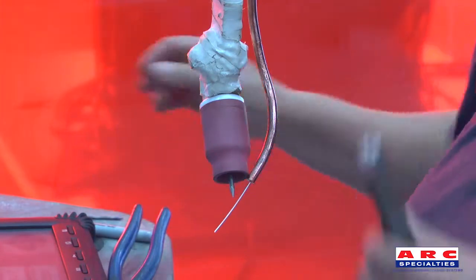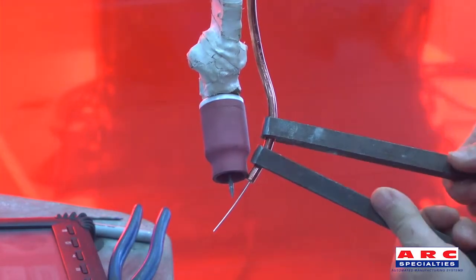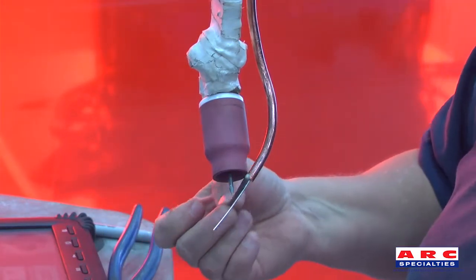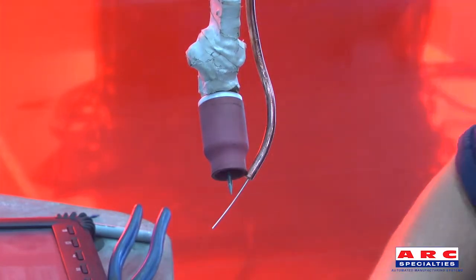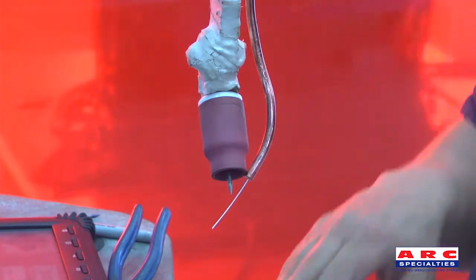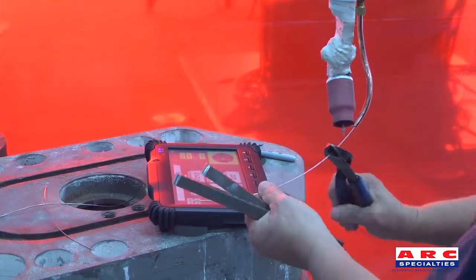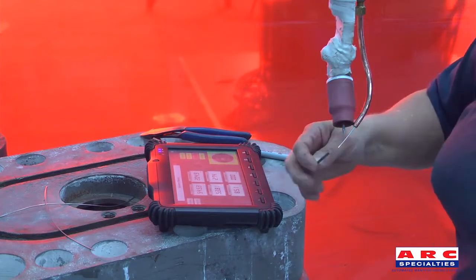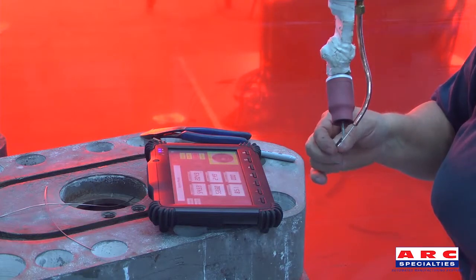Notice that there is a big gap, so here the gap is being closed a little. Take a 1/8th tungsten and check the gap. If it's a little too tight, find the most bent spot and unbend it there — it won't take very much pressure. Every time the guide is bent, the wire is also bent, so run the wire down until it's straight. Don't be afraid to waste wire. If this is done right the first time, it won't be necessary to change it while welding is taking place.